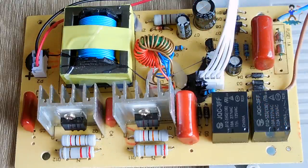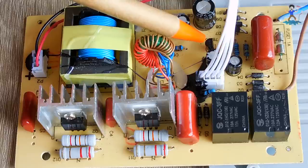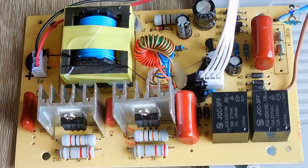And then right down over here, you see there's about a 2-watt resistor, and then this diode, a 12-volt Zener diode. At this point here, the 12 volts supplies power to the rest of the circuit, but this also, looking at the traces on the back, is what supplies power over here to the input side of the 7805.